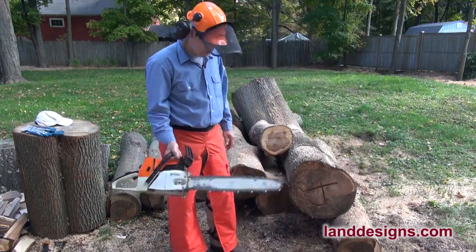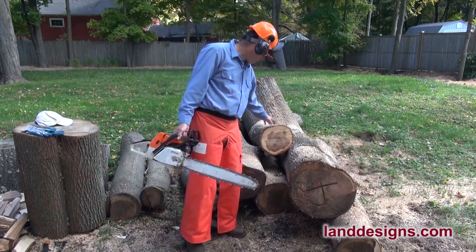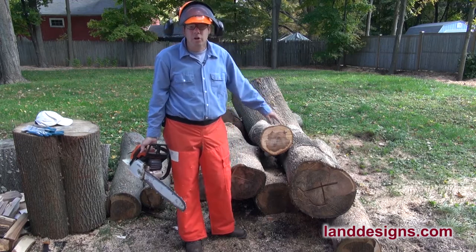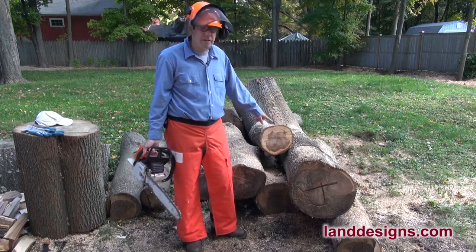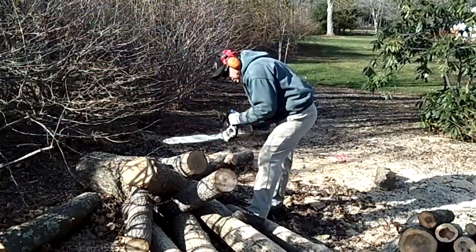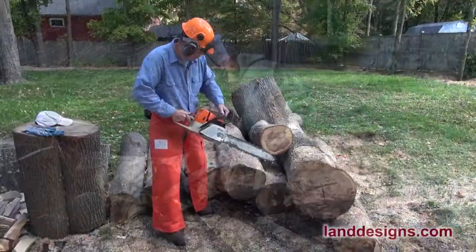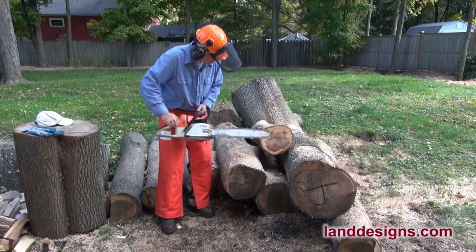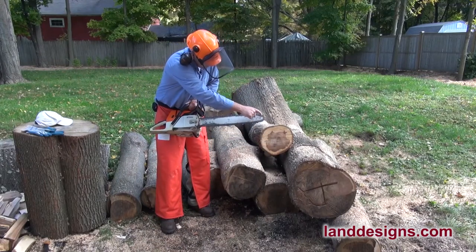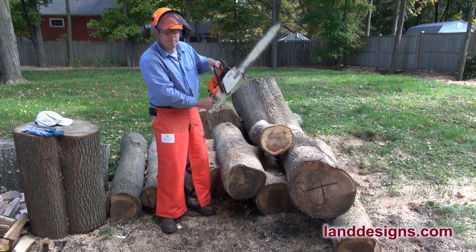So there you go, guys — that's the new gear. If you're ever cutting on a pile of wood like this, I do just want to caution you. The only times I've ever really had trouble with kickback — and I'll show you a video I filmed a few years back — was on a pile. Because once you get that tip of the bar in the pile and you catch, it's this part of the bar right here. You've got to be real careful. If you catch this part of the bar into another log, she's coming back at you.